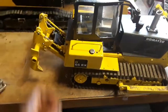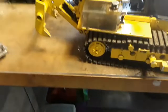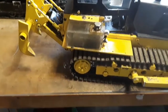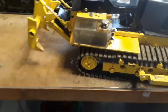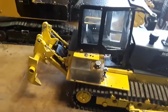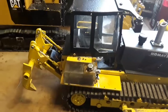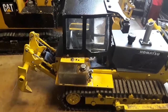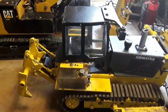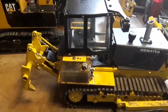Here's the big problem. I've changed the oil about three or four times and this is how it looks after a run — it's all gray and cloudy, almost like it's got water inside. I talked to a couple of guys online and a person in my church who does hydraulics for a living, and they told me there's moisture in the system. Since it's been sitting so long, the seals are dry and the grayness is basically old rubber.